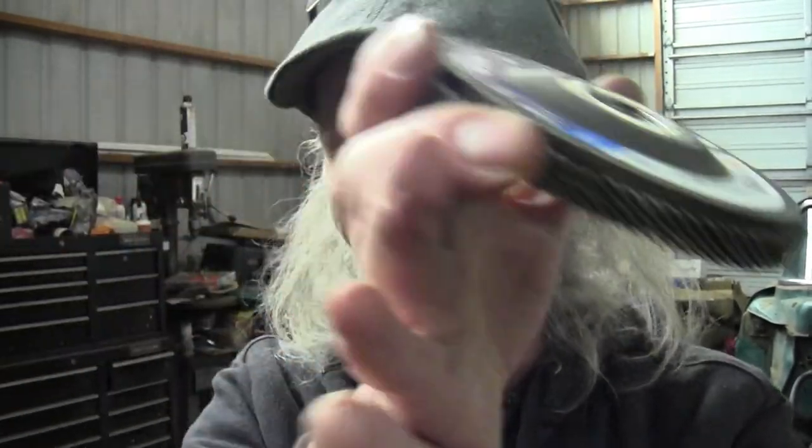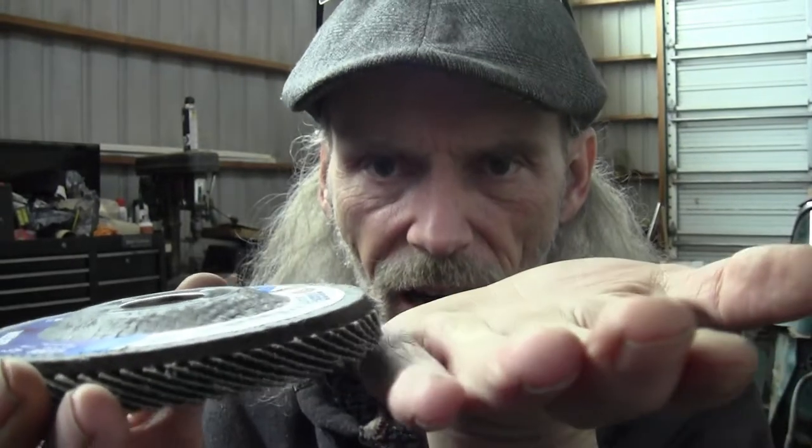Also, you can see they're a 90. I know after a while this will wear down into the standard cone-shaped ones you see all the time, but I can get right in on a hard angle that I need. Say I'm working on a 90 degree and I've got to get a flat in there. I can grab a new one of these, chuck it up, zip that part off, pull it off, throw on an older one that's rounded from being used for a little while, and go right back into my flat, nice, easy polishing weld.